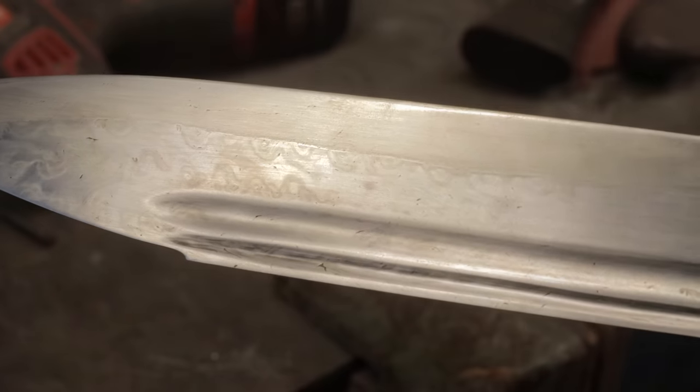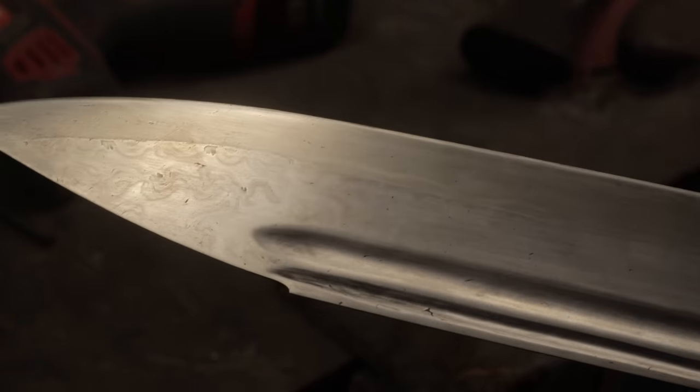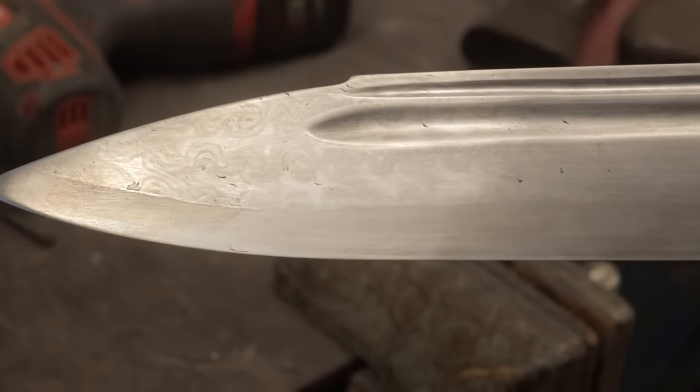It is actually more likely that they took their blades, high polished them using stones, just like the Japanese culture does with their katanas, and in that very high polish, you have a very clear look and glimpse into the blade, and you can see the different types of material, in this case iron and carburized iron, will show the pattern just like it does right here.